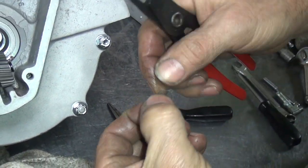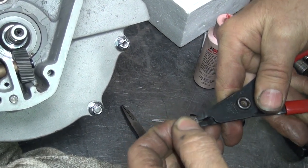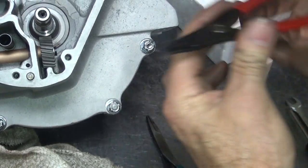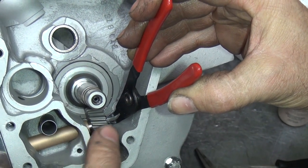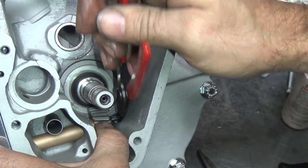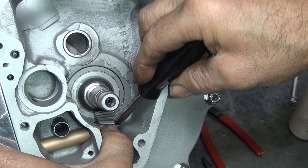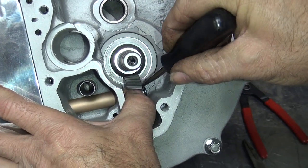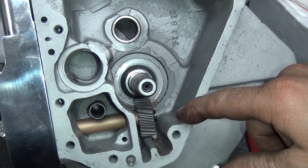Now you have a radius side and a sharp edge. The sharp edge goes to the outside so it sticks in the groove better. Notice how the pliers don't want to work now — I did that because now it has more tension. We want it to be tight on here, unlike the other side which was loose. Because when you open this up to go in there, you have to keep opening it until it gets in there, then you get the hell out. And if you're lucky, it's tight on the shaft. See how it's tight on there? Good and tight. If it just spins, it can come off. If it's tight, it doesn't come off.